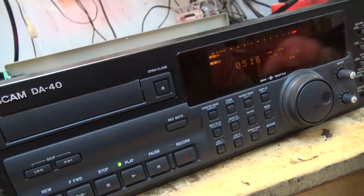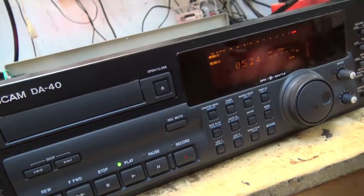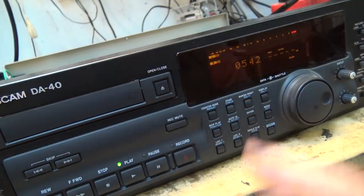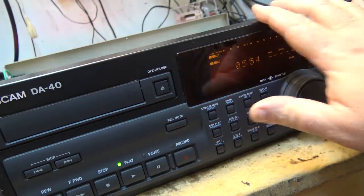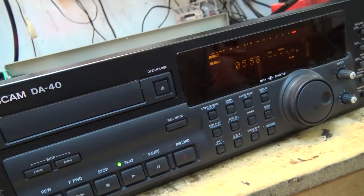We'll try this out and see whether it's going to make a recording. It definitely plays back. So what I've got to do is figure out why I have no idea at this point. But obviously it's not getting data — the data's not being passed from the deck into the display circuit. I'm not getting the VU meters, but that might all be part of reading the data stream. At least I'm making progress — we know the deck works mechanically. It's playing the tape fine, so we just have to deal with this display problem.